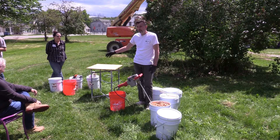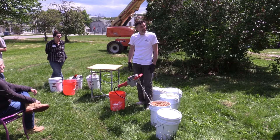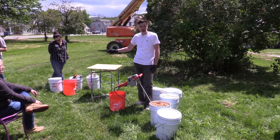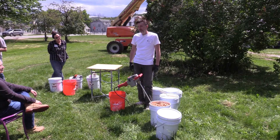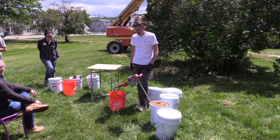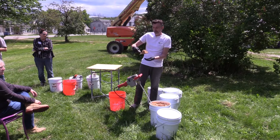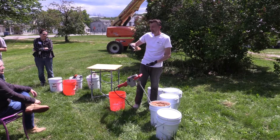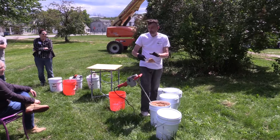In 30 years I've rarely found that to be true — I think somebody was winding him up as an apprentice. If you feel it needs more water, go for it. At the consistency it's at now, if you have any repointing or outside masonry work, that's good enough — you don't want any wetter than that for pointing because it'll stain the masonry. But for plastering you'll need it wetter.